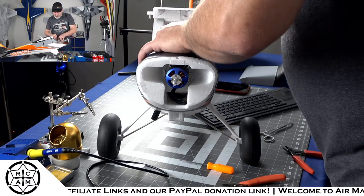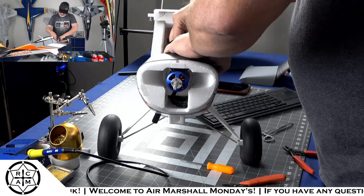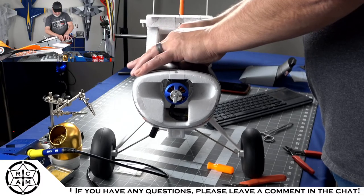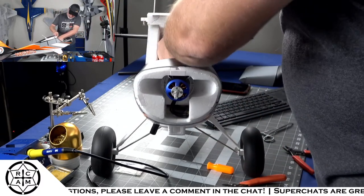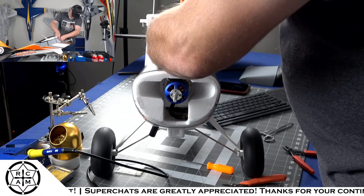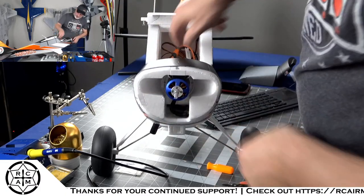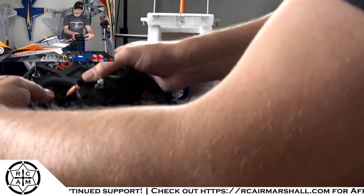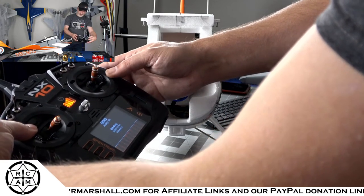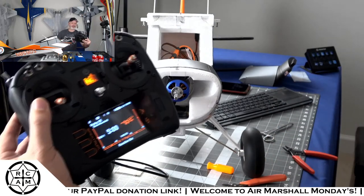All right, so we got our big fat 3200 4S pack in the Husky. Oh shit. I'm gonna reach back there and press the button. Put our receiver in bind mode. Press the bind button and turn on the NX10. Binding. DSMX 22 milliseconds. Telemetry. Bind complete. All right, we're configuring some telemetry right now.